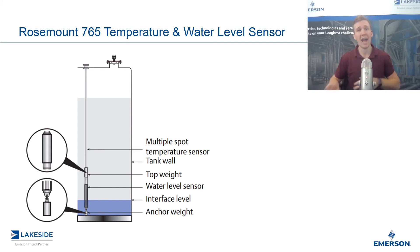And you definitely don't want to pump away your product because your product is very valuable. So what we've done is we've added a capacitance probe to the end of our multi-spot sensor. We have both a 20-inch and a 40-inch option, depending on how much water you expect to be there. It's looking for that water-oil interface and reporting that as a level or water bottom measurement for you.